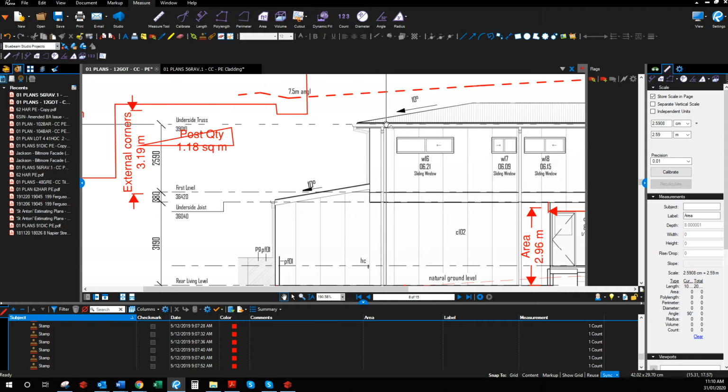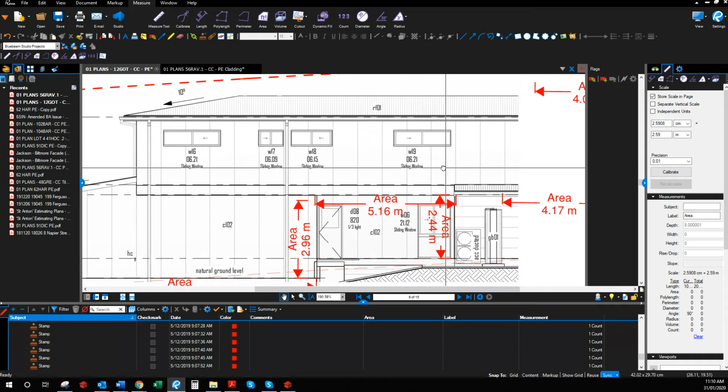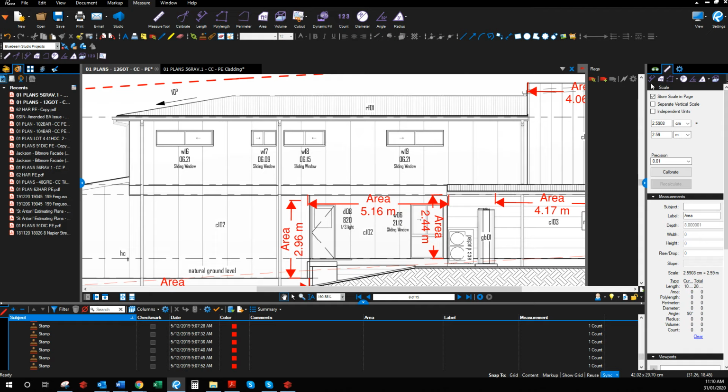So we've got ceiling height here. So again, we're just going to use the 3 meter boards. So that's all we've got to choose from in the 900 size. So I'm just, again, going to take a measurement from here to here. So we've got 14.6 divided by 0.9. So we're going to need 17 sheets on the top.